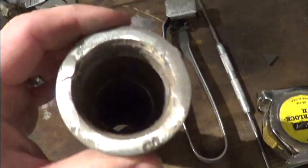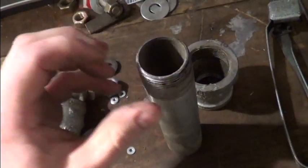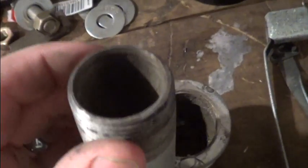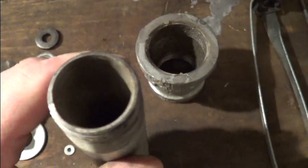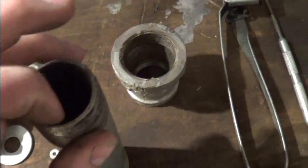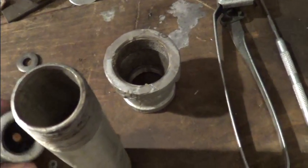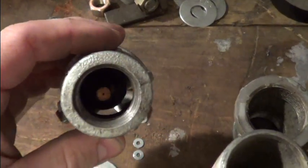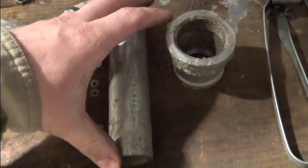The main thing you want to do — this burner hasn't run — but you get the black pipe and if you can see in there, there's a lip. You want to file that lip down, otherwise it causes an air eddy in there and causes your fuel not to mix right. The main thing is you need to have a gas-tight weld on that nut. It just uses a quarter-inch nut welded on the end. You want to file that down.